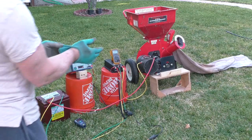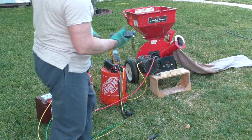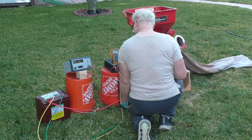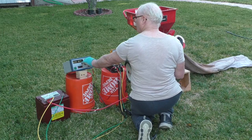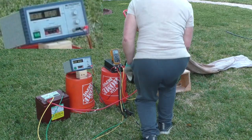Time to get testing. The first part of this test is to ensure maximum RPM does not exceed 4000. I will have to slowly power it up while monitoring the RPM on the tachometer. Making sure everything is turned on, I ramp up the power. It starts up right at about 6.5 volts on the throttle.